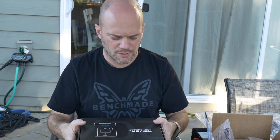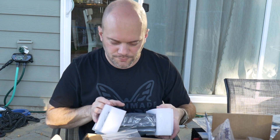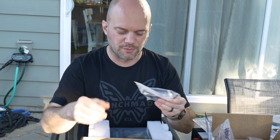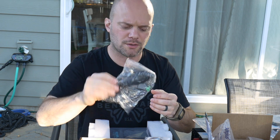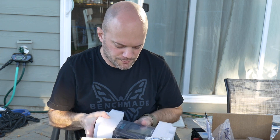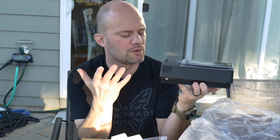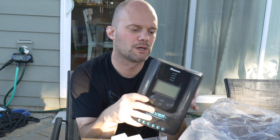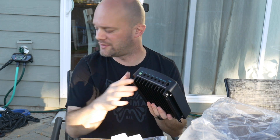They give you a charger — we got the 20-amp MPPT charger. We've got the controller here, Renogy. Looks like we have a controller, and I think this is the battery temperature sensor, which is pretty important. You put your positive and negative solar panel leads into it, and then your battery positive and negative. I'll get the battery here in a second.